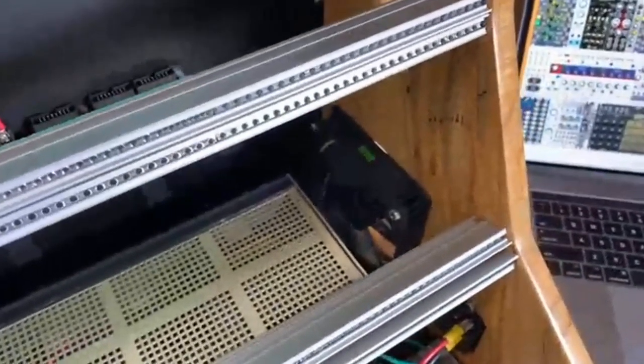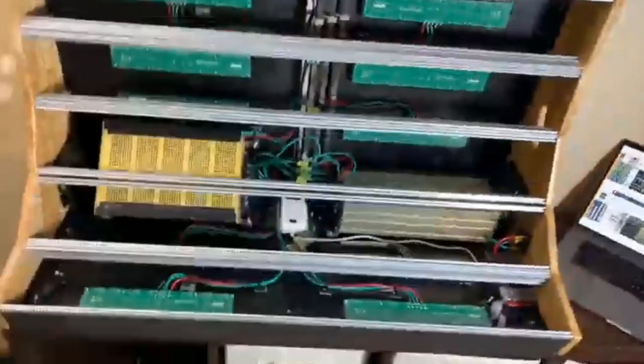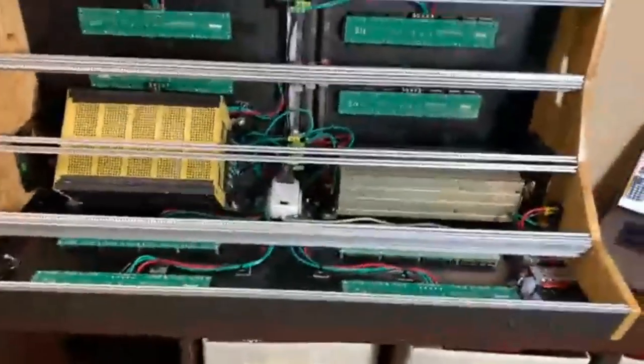So you're pulling air with the fans, Chris, across horizontally, and there's also holes top and bottom. Yeah, the way I think I'm going to eventually run this case, although this is still to be tested, is I'm going to probably run both fans pulling air out of the bottom left and right corners. And you can see the fan outlets on the corners of the case there. So there they are on the ends. And I think I'm going to have them pull air out of the case, and it's going to come in through the holes that are underneath the power supplies.